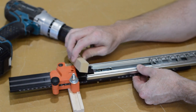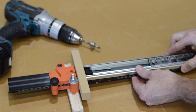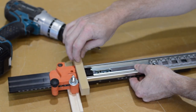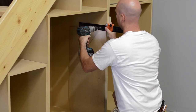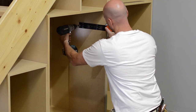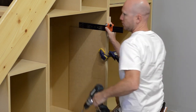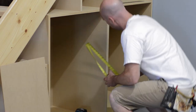The drawer fronts are going to be inset — meaning they sit inside the opening of the cabinet versus laying over top of the edges. When using this jig, I like to cut a spacer, which ensures that the drawer slides will be dead parallel to the bottom and that the left and right sides will be equal height from the bottom.